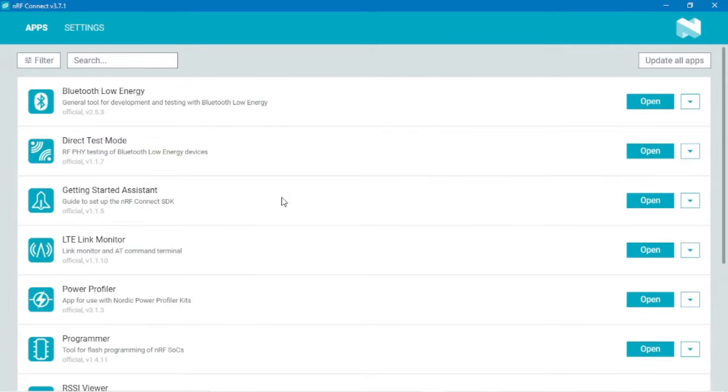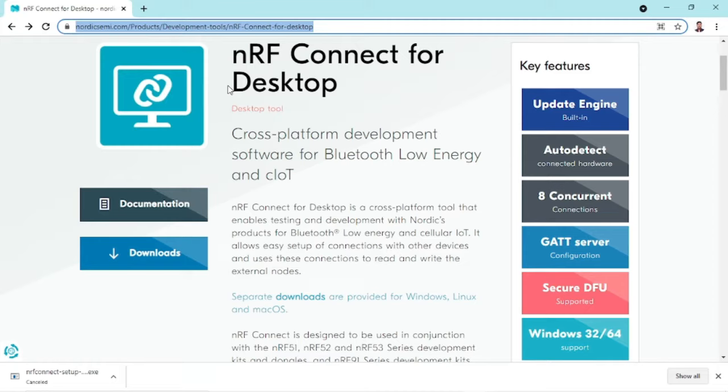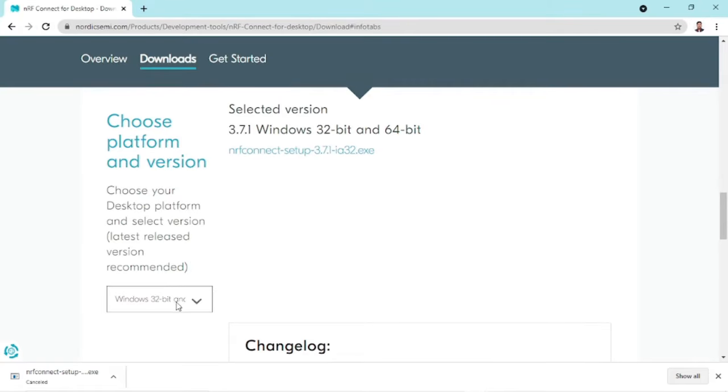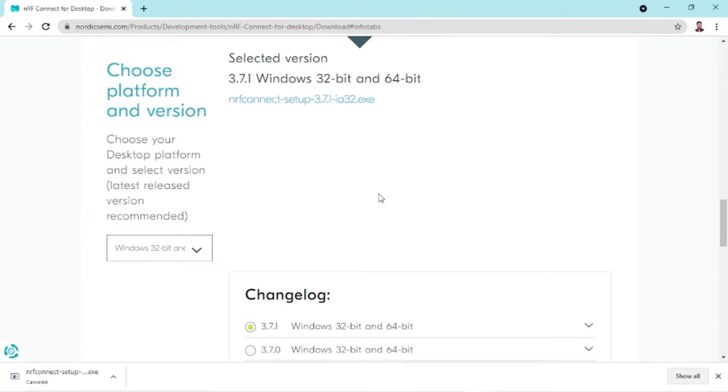If you don't have the app, you can download it from Nordic's website, the link of which is given in the description below. Now on the website, you'll be greeted by this page. Click on the download link and you'll be taken to another page. Now on this page, choose your operating system. Since I have Windows, I'll be selecting the Windows 32-bit and 64-bit option. And in the changelog, select the latest version. So I'll be selecting 3.7.1. Now in the link above, click on the link to start the download.